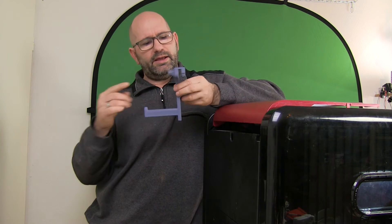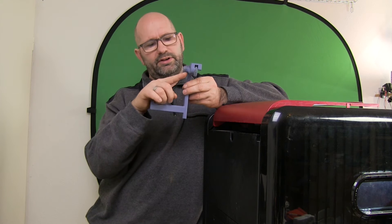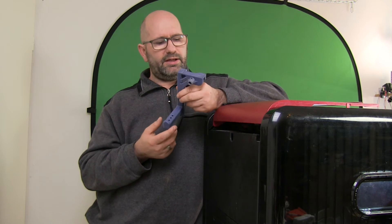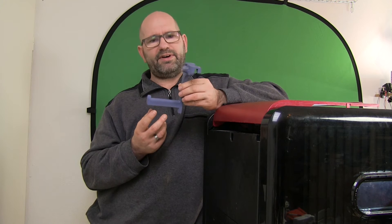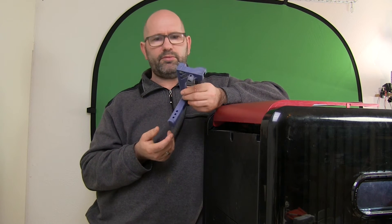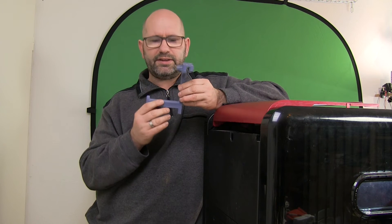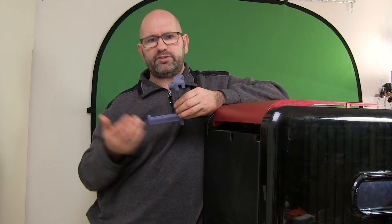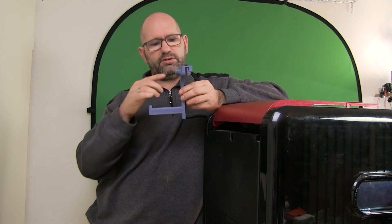So the problem with this filament holder is that there is a little bit of wear. When the filament goes through it goes under an angle, so here at the bottom side there is a little bit of wear, but also here at the back side there is a little bit of wear. After a year of use I found that there is so much tension and friction that the filament is actually being held back, so my extruder motor has to work very hard just to get the filament in. You can hear the motor make a clicking noise sometimes just because it couldn't pull the filament in.